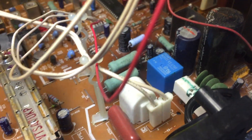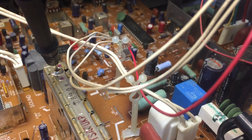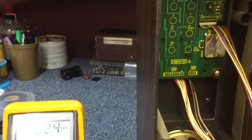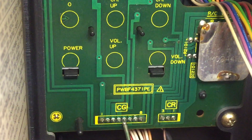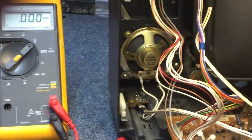I've just kind of gone through this portion of the power supply, looking at the resistors for anything that might be open. I did confirm that we do have some voltage coming in. They will drop that 120 volts down to a smaller voltage because we still need 5 volts at the microprocessor before we can turn on the deflection circuits and so forth. I also took out the keypad to make sure that the broken button wasn't holding a line load preventing turn-on, and I didn't find any issue there. I fixed that power button while I was in there, melting it back together so we could try the actual power switch.